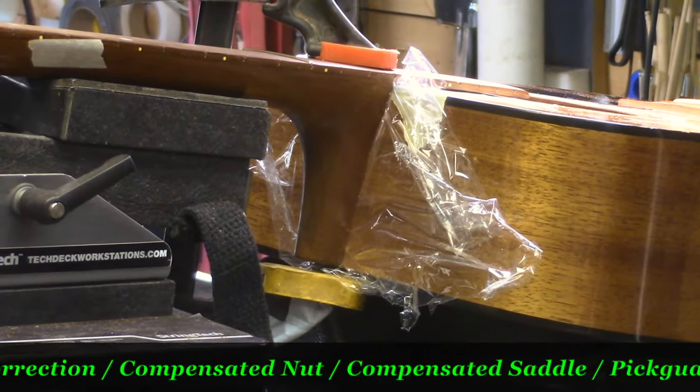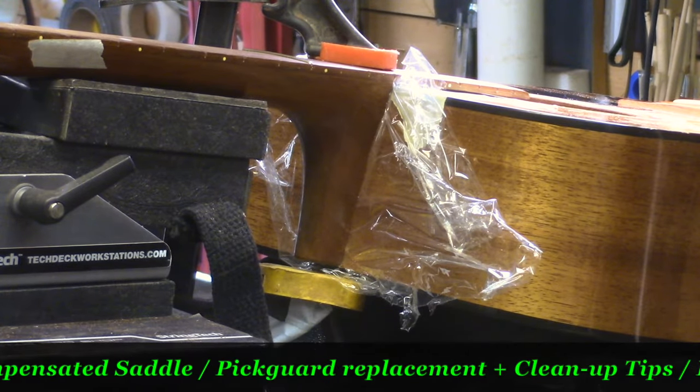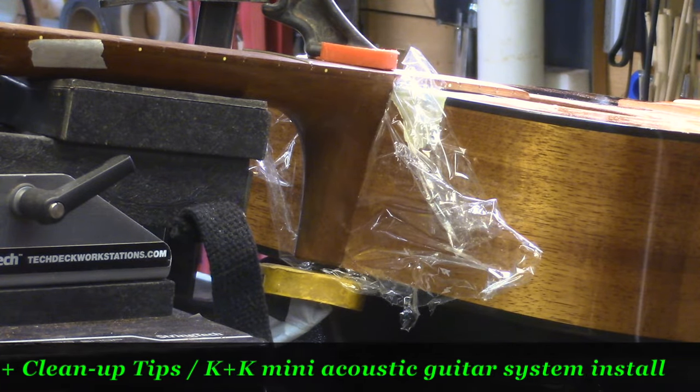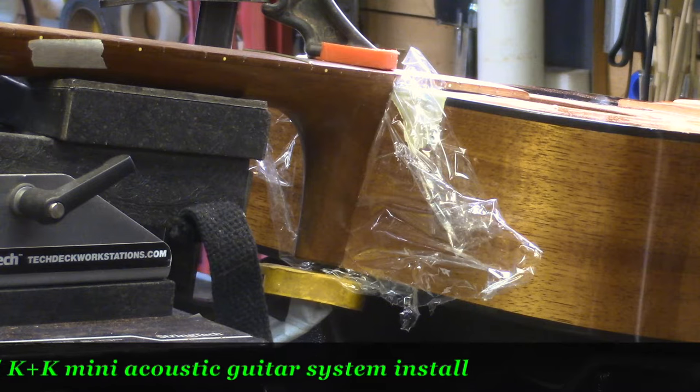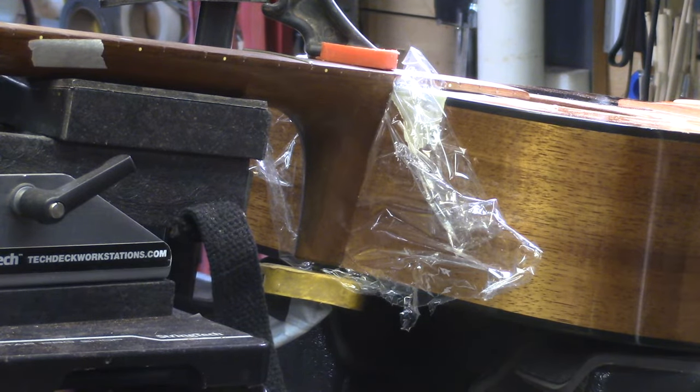It's a 1980 and I thought I would bring you in at this point to show you what I've got. I have gone through all of the geometry to get everything right and everything lined up and I am gluing the shims in. I thought I would show you this as I take it apart — sometimes it's better to explain it as you see me disassemble. I have press fit that male dovetail into the female dovetail in the block with the appropriate shims which are a little too thick, and that's what you want. I'm going to work them down to the right size for a perfect fit.